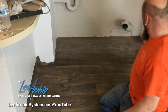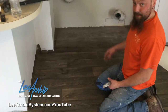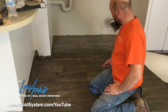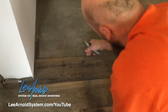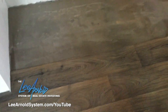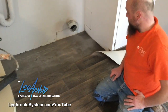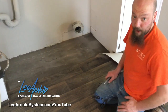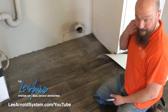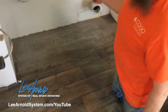We have a section here that doesn't have any flooring. This vinyl comes in a 12-foot width, so a lot of times you're going to have to put a seam in it, which is not a big deal. It has a nice little factory edge you can see on the flooring — the black lines. When you go to do this, you leave one line on your main piece and take the other one off your fill piece, so when you butt them together it looks like the rest of the flooring. You come back with a seam kit — Armstrong makes a nice one — and you seal up your seam so water and dirt don't get in. This is where we're going to have a washer and dryer, and if water leaks it can get into your subfloor or drywall and make a real mess.